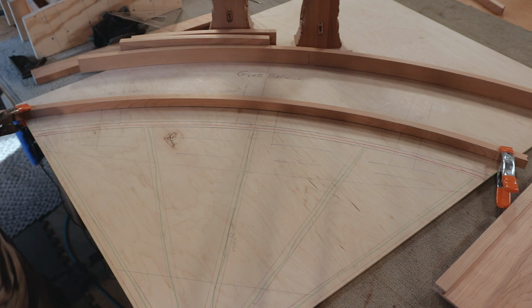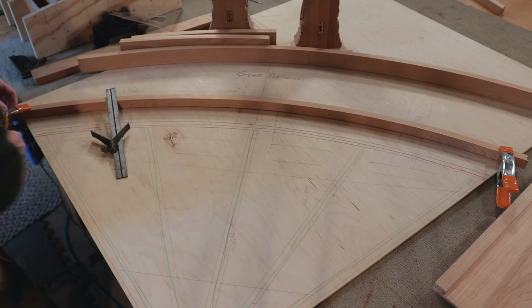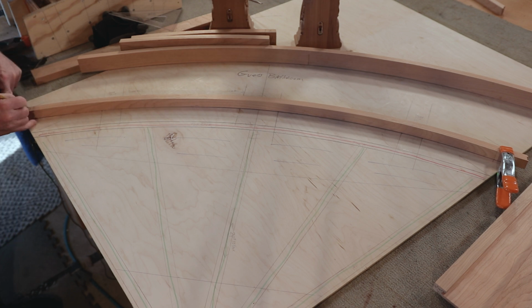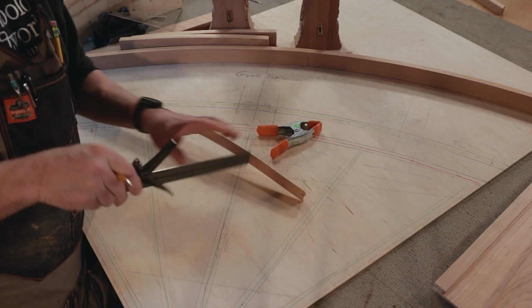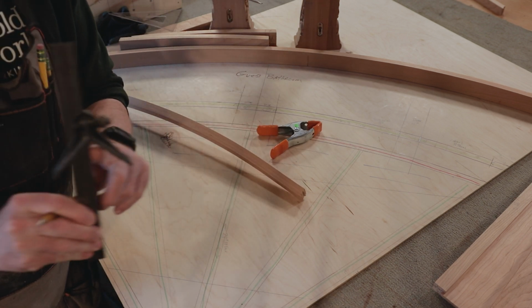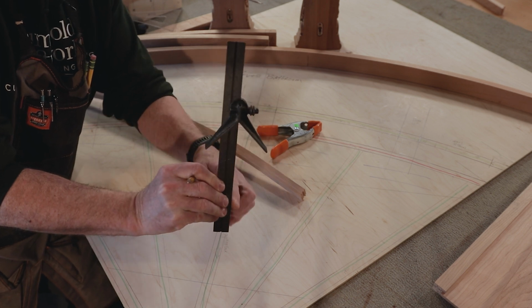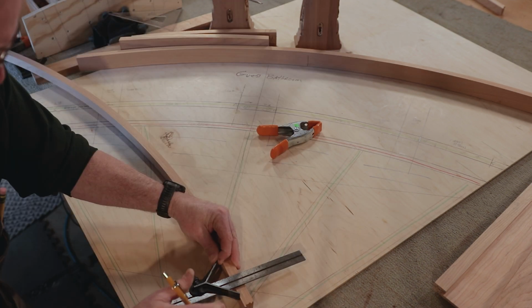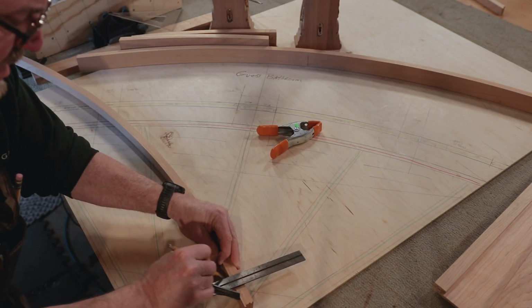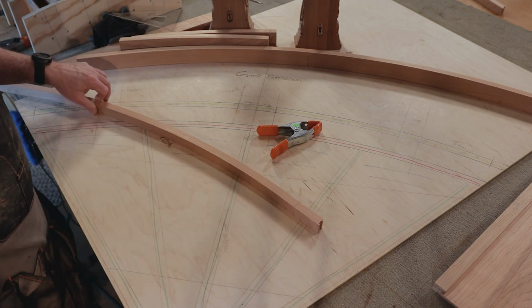All right, and either we use our center finder, if you have room, and put a little line here, and go ahead and mark it like this. And I'll mark the other side since it's over there too. And you've got to remember when you're using a center finder, where's the lens? When you use a center finder, this is the side that works. It doesn't work on this side, right there in the middle. And I'm going fat of the line just by a pencil hair or so. And we'll mark it, put a little hashtag on there, flicky, that's where I want to cut it.